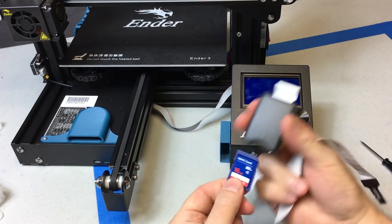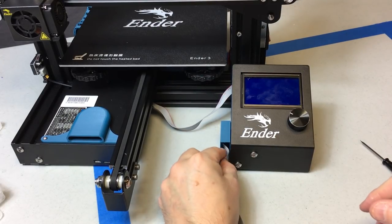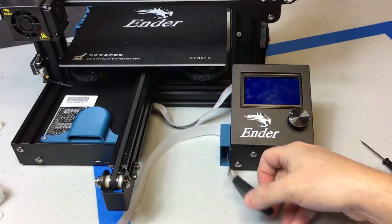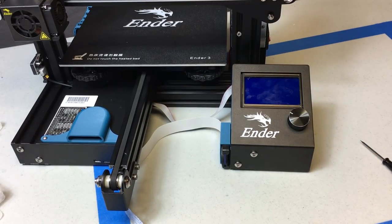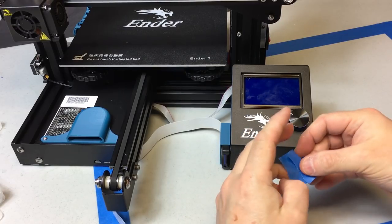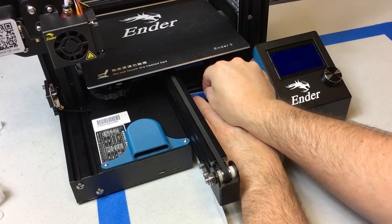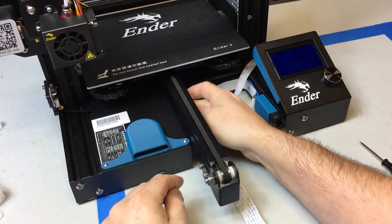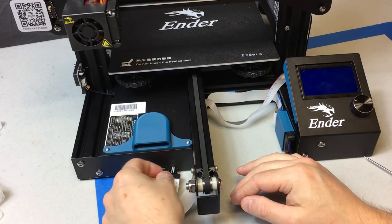With the adapter for the SD card — they're all pretty much the same whether you buy the one I-link or a different one. Just feed the ribbon cable in through the back slot on the mount, pull it all the way through, and the mount will be a pressure fit for the adapter. Get the one suited for the adapter you buy. You're going to want to keep these cables attached to the aluminum extrusions somehow — I'm just using tape. This is going to keep it out of the way and keep it from being snagged on anything. The last thing you've got to do is plug the end into the micro SD slot on the unit and you are done with this upgrade.